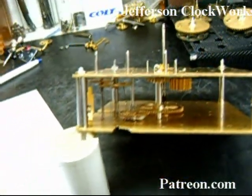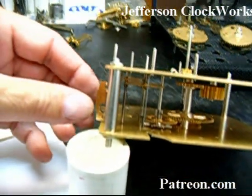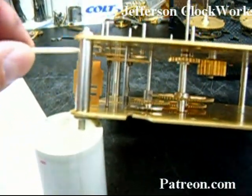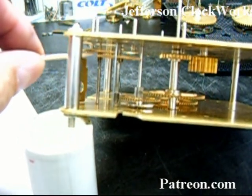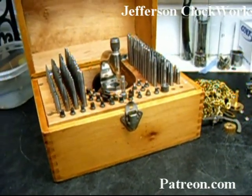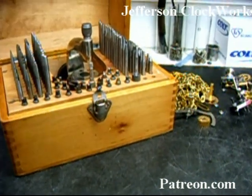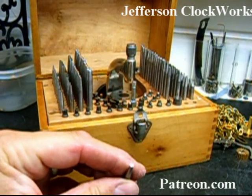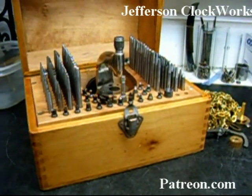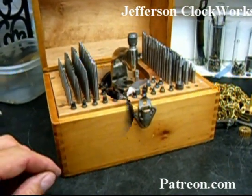I've got the strike side back in right now and we're going to test out everything — all the bushings I put in. First thing is to check out the shake. This one's got good shake — that's the fly governor. The next wheel looks good too. By the way, the way I move those bushings slightly outwards was with a staking set. This happens to be a watchmaker's staking set. I just use the punches, select the punch that's a little bit smaller than the bushing, and move the bushing exactly where I want it. It's a great little set to have — you can get them on eBay, probably a lot cheaper than the tiny sets sold for clockmakers.